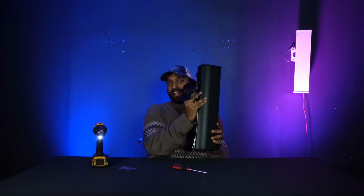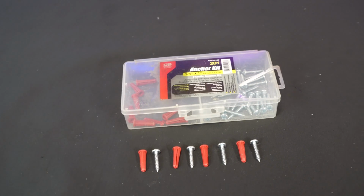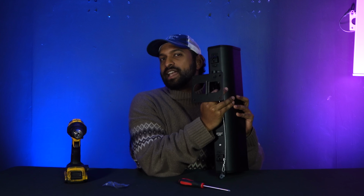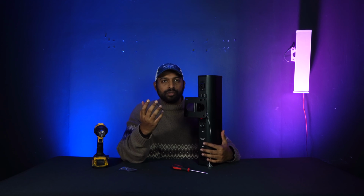So now the next step is to take the horizontal base plate with the speaker on it, and we're going to screw this into the wall using our screws that were part of our anchor system. Remember, those are anchors and screws that you need to get separately. And again, we recommend 1/4 inch anchor systems. I'll talk to you and show you visually what to do.